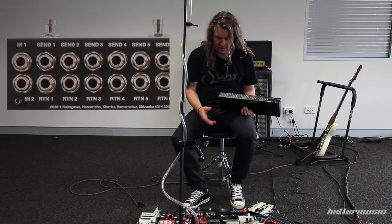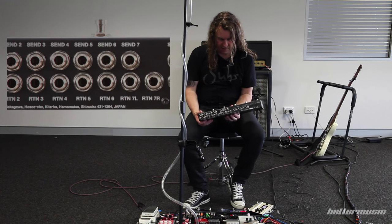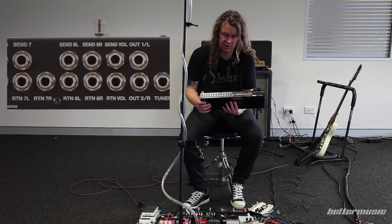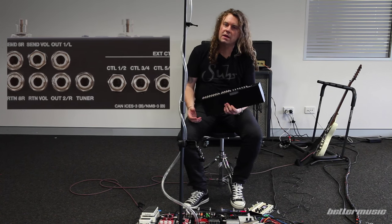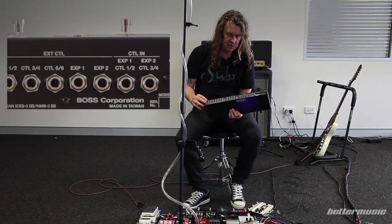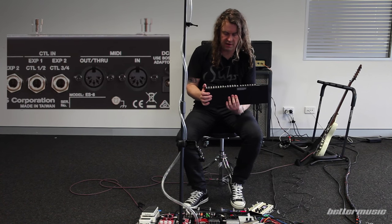It's great that they've been able to do this. This new Boss unit is a lot better than the one I have, with a lot more features. You can run effects in series or in parallel — there are two mixes in it that allow you to do that. The reason the sound isn't affected by loading down different devices is that it has a buffer on the input stage and on the output stage, which is defeatable. So if you do have specific fuzz pedals and things like that, it's not going to ruin how they sound.